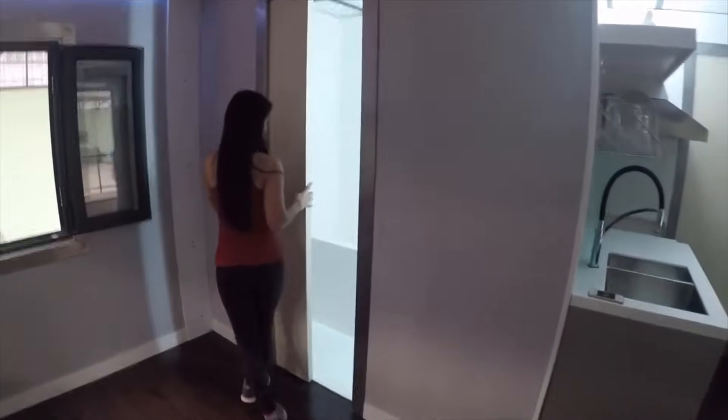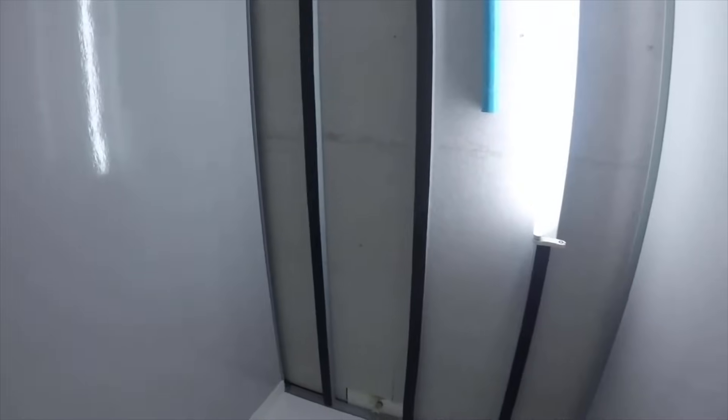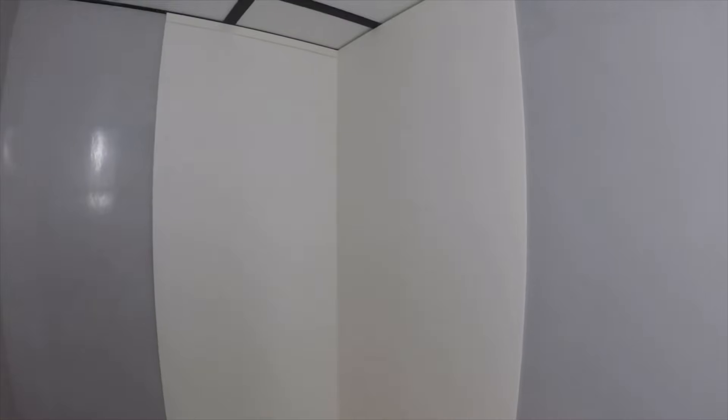Just through this pocket door here is the bathroom. As you can see, the bathroom is incomplete at this time as we're working on our final mechanical drawings and cannot close this wall yet. What you can see is our custom-made Japanese soaking tub — the tub as well as the floor in here are made from solid surface. All the room's walls are covered in FRP, same as the rest of the house, but with a solid surface floor and three inches of base molding. This floor drain in the middle effectively makes the whole bathroom floor into a shower pan.